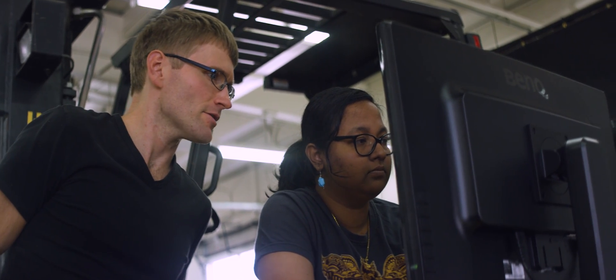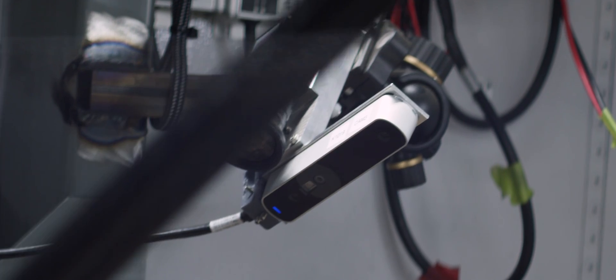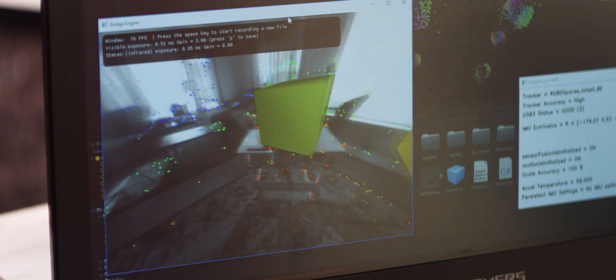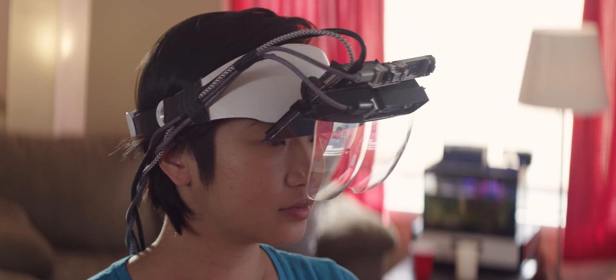The Structure Core has been really great for giving us varied positions that are accurate to within a few millimeters. It has an officially supported Linux SDK that works well. That has allowed us to integrate a lot more successfully and also feel a lot more confident about the camera we're using. The global shutter is pretty important for us because we get a whole frame all together, and this really helps with feature tracking and also the environmental mesh interactions.